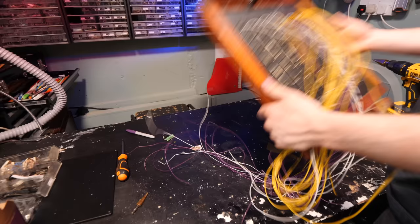These are the wires that connect to the piston buttons around the front of the keyboard. For instance, for the bottom keyboard, this one attaches to all of the buttons on one side. We're going to wire this to ground. Then we're going to wire each of these to the designated pin connections on the D-sub connector, so it then travels over to the preset board.